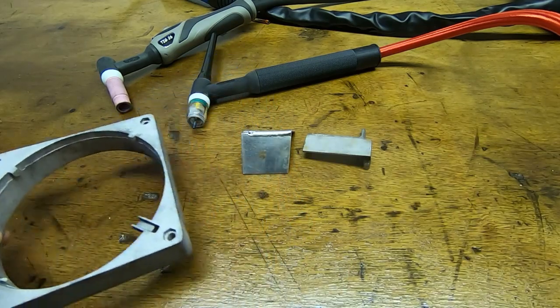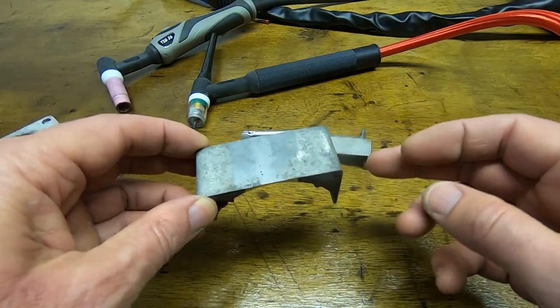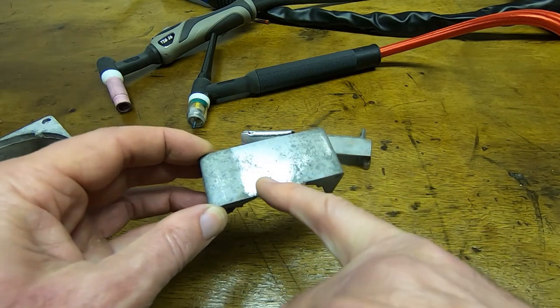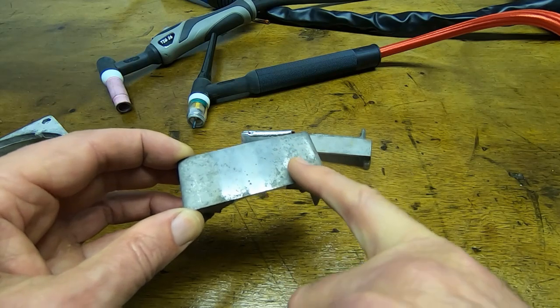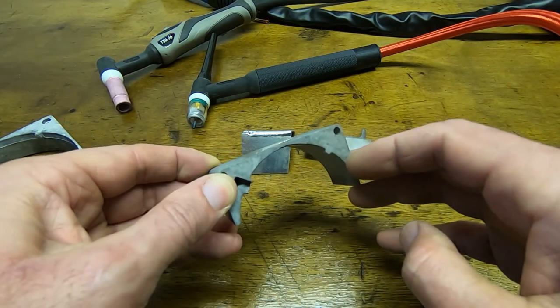And what I'll then do is I'll try and weld it up, and this is one I did yesterday. Similar type of material. I broke this in half, and the porosity is not the weld, this is just the material. If you grind any part of this even before you break it, you'll get these little holes. As I say, this is very porous material.